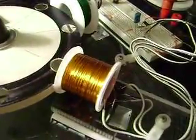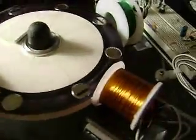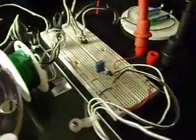Over here we have a reed switch for this coil. This coil is just getting its own voltage into the cap from the rotor spinning, and the reed switch connects across the coil. As the wheel turns it generates a little voltage into these caps, and then at a particular time the reed switch shorts out the coil with the cap, then releases it and dumps the voltage back into the caps.